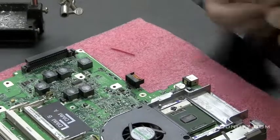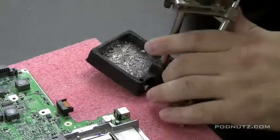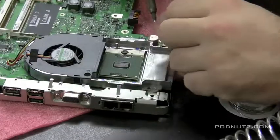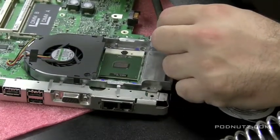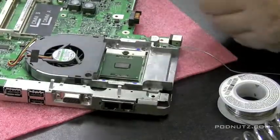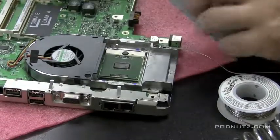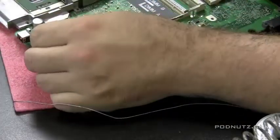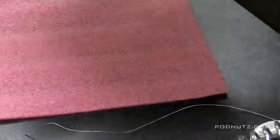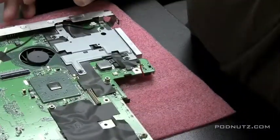I'm going to use a device called helping hands from Radio Shack — it's actually missing one alligator clip, so it's just a helping hand, but it works. It allows you to hold things while you work on them, like an extra set of hands. What I did with the helping hands was solder both ends of that wire — I didn't catch that on film — then I put a dab of solder on the back of the power jack at that filed spot. The outside of the power jack is the negative ground connection.